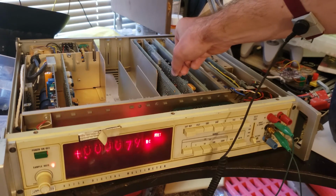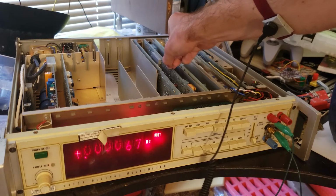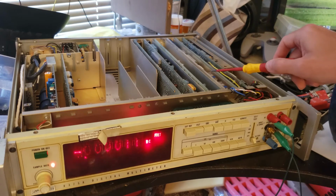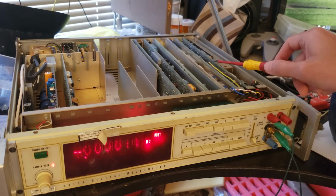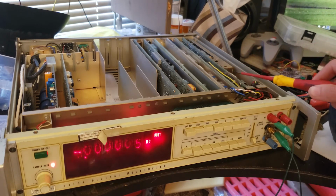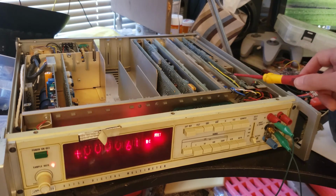But it can induce some glitches, but not those offsets. I'm going to try to tap these relays and see if the relays are bad. Tiny bit. This one. Ooh. That one might be it. It only flips when I tap the body of the relay, not the circuit board. So I'm pretty sure it's this relay and not the edge card connector.